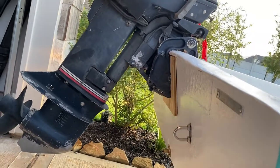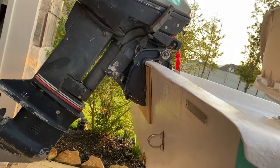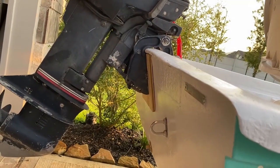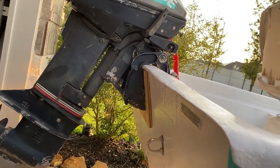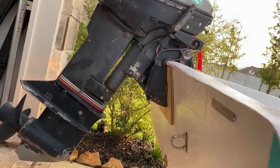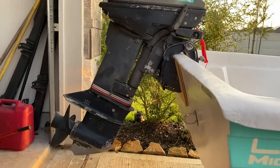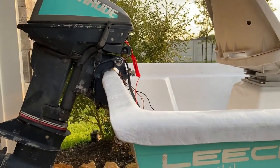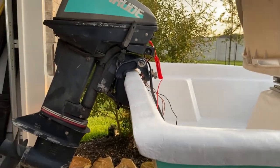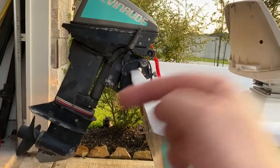Bad mistake, but not major at the moment. Based on my mistake, I need to space this out slightly to not completely crunch that. But I fiberglassed the whole thing, so I'm not going to redo that. So I cut that board, pieced it in there, I'll take it back, fiberglass over, coat it, and just make it part of the transom right there. And honestly, probably just reuse that one-eighth plate right there that I got and just drill through and bolt the motor to the transom.